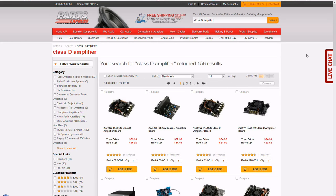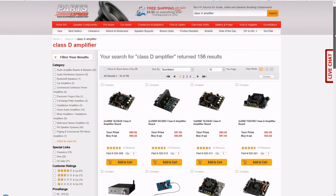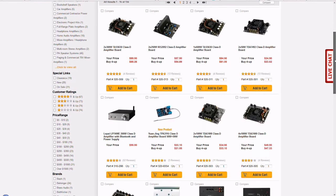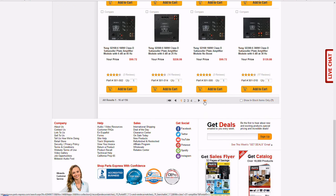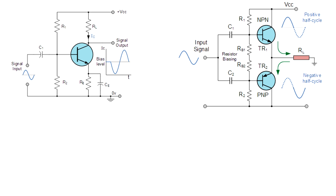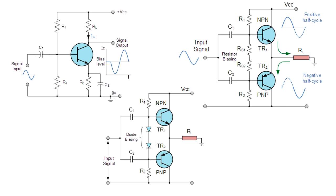To start I needed to choose an amplifier, as it is the heart of this project. Oftentimes with portable devices like this a class D amplifier is used, but before we use one let's take a look into how one of these amplifiers works. These amplifiers work in a way that is very different to that of a typical class A, B, or AB amplifier. Those amplifiers work through amplification of an analog signal through a transistor or a transistor network. They have low distortion but high losses, being only about 60% efficient at best and 20% at worst.